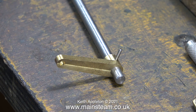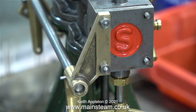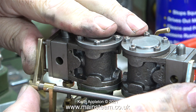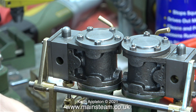This is one of the drop arms on the reversing shaft and I'm about to tap the pin into place to hold it. Please note this is not a big hammer even though it looks that way in the video — it's only one step up from a toffee hammer. When I fit the reversing shaft into the brackets it's a bit too short. This view shows where I've ground away some of the bearing to accommodate the drop arm, and I had to do the same at both ends. This is no big deal — it's all part of fitting it together.